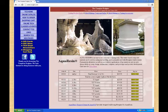I have tried one cast that I'll show you here directly, and for anybody that wants to see it, out in the lobby. And what I can tell you is that the pot life of this stuff is advertised as effectively a polyester equivalent. I found that it set a little more quickly than that. On the shorter plaster side, I was uncomfortable making the cast I did because the brush was hardening up.